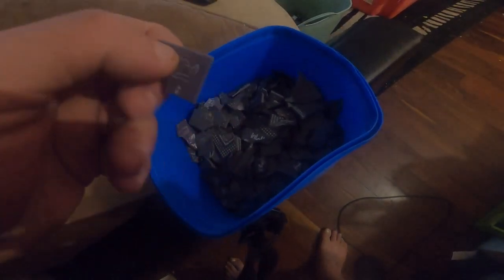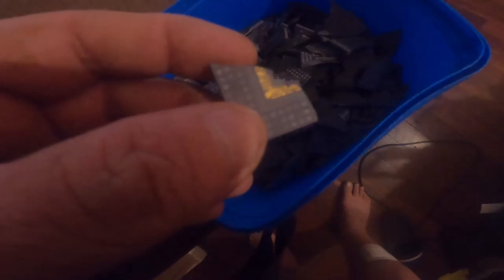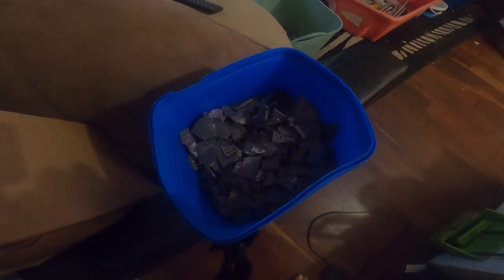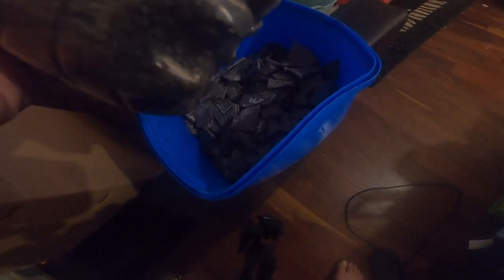The only gold I can see anywhere on these bits is the centre parts. I've told the person who owns this they're not going to get a lot of gold out of it — they're only going to get the dribs and drabs. The bulk of it's already been taken. I've also got a bottle of crumbs they've smashed to pieces; I can't see any gold in there whatsoever but I'm going to treat it just in case. There's no point trying to burn base metals because it looks like it's already been in nitric acid, so I'm going straight for aqua regia.